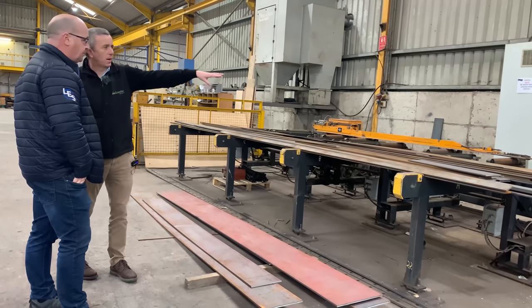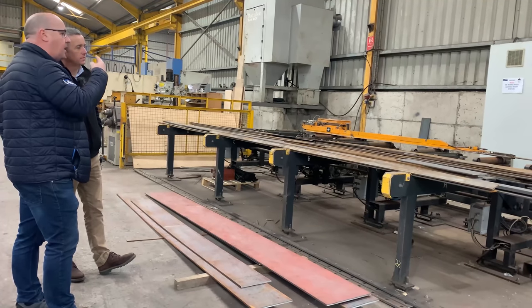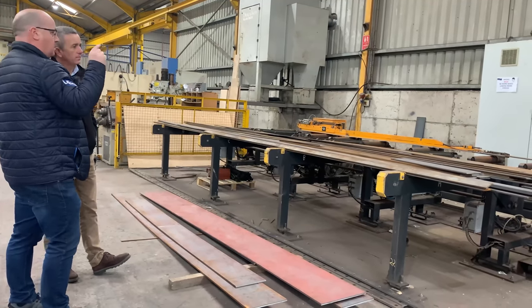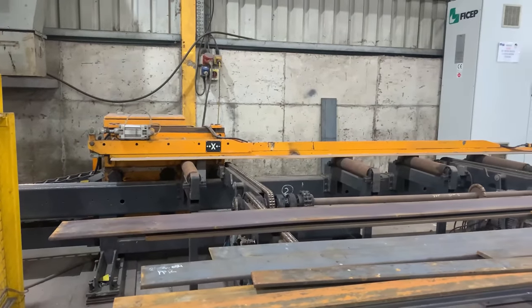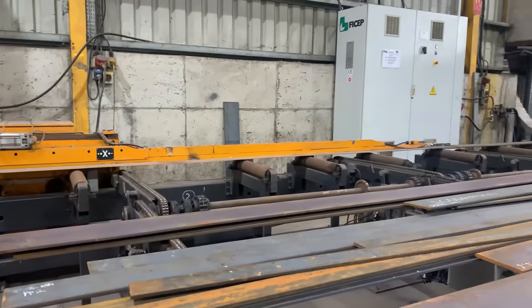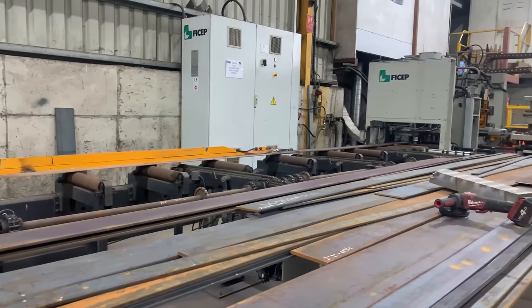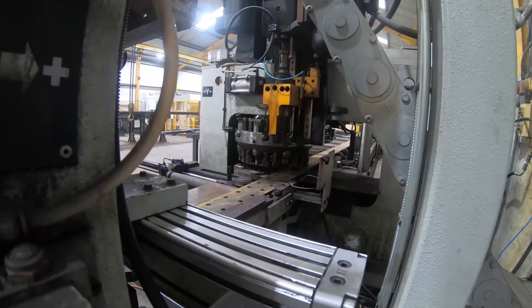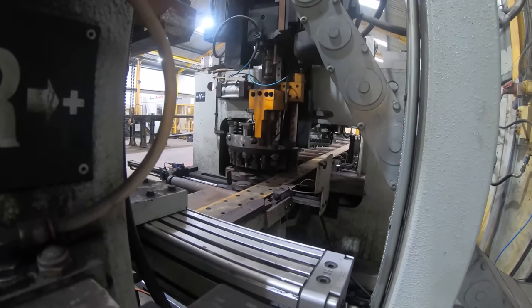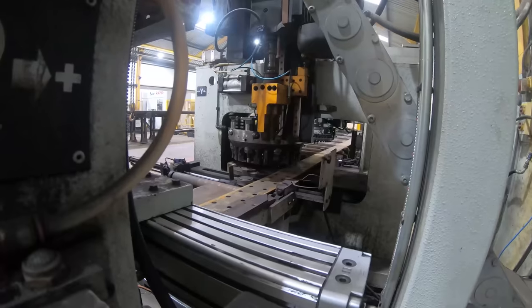So from the conveyor, what machine is it going on to? Basically, as you can remember from earlier on the drilling line below, you start here with the same setup again. You have your gripper and it puts your bar straight in. The first process is it marks the number on your plate, then it punches the plate, and then it cuts the plate. Those are the three processes, and you can either punch it or drill it — you can use the drill or use the punch.